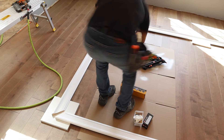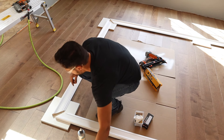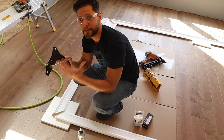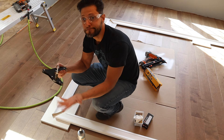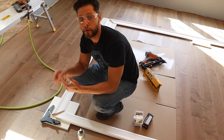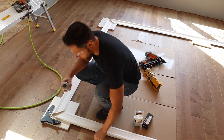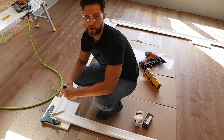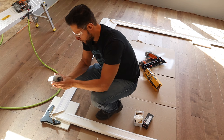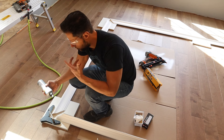Now we're going to pre-assemble the miter casing before putting it up. I'm going to be using these cam clamps — I'll be brutally honest, these things are great but they are expensive. I'll link them in the description. Most of you probably won't be using these, especially if you don't do this for a living. If you do, you'll be buying a lot because they're great for gluing. I'm also using Titebond Quick and Thick because it cures much quicker than regular glue and is a lot stronger because it's thicker.